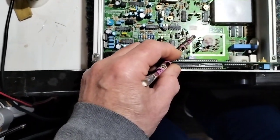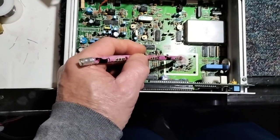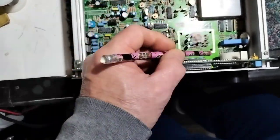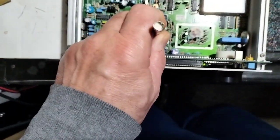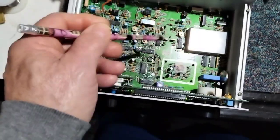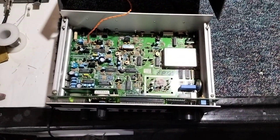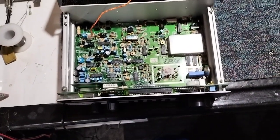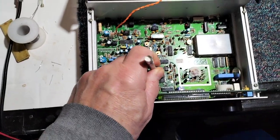You'll be wondering why this resistor is here. As I say, this voltage is a bit high, and the voltage coming into this circuit should be minus 1.3 volts or something — I need to get the diagram back out. It's actually 1 volt negative too high because the output from this chip is too high. So all this resistor is doing is dropping that voltage down to roughly within specification, and that has actually brought the oscillator down to working at 12 MHz — rock steady and stable.